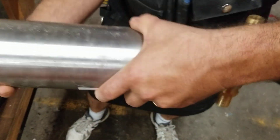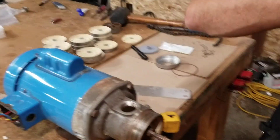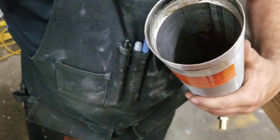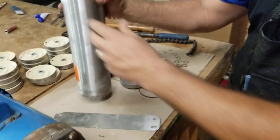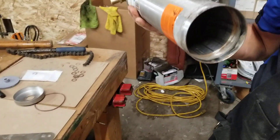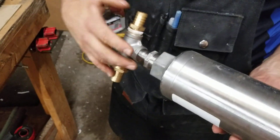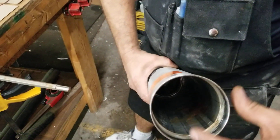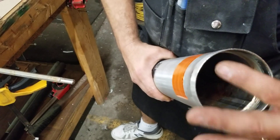Once that broke loose, the barrel came off and we had a bunch of diffusers and impellers wedged inside. What we did is I basically pushed them back down in there, cleaned some of the plastic pieces out, and then just tapped it on the ground to let them slide out one at a time — I had to do that multiple times. After that, we took the whole barrel and soaked it in a mild acid bath to get the rust off the surface and to clean out the inside. I already put some magic lube on the threads, so we're putting it back together.